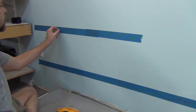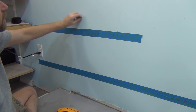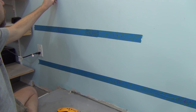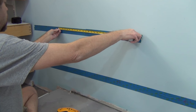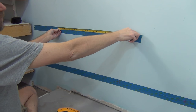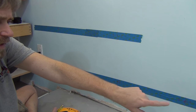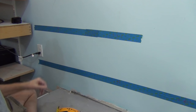I'll mark that up. There's a gap right here of about 21 and a half inches. So that wall really messed things up, but we know we're 16 inches, 16 inches, 16 inches — and then we have this little gap where the main wall of the house is. Not a big deal, we can still figure it out.